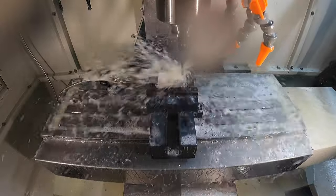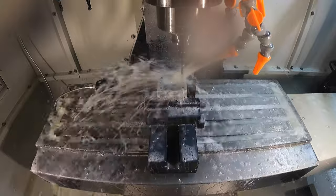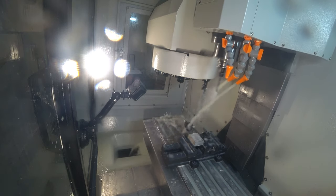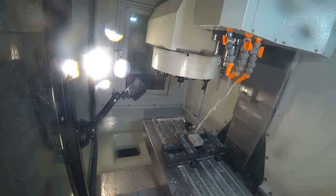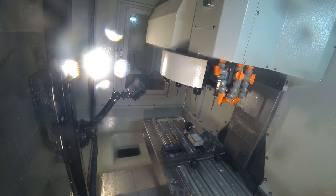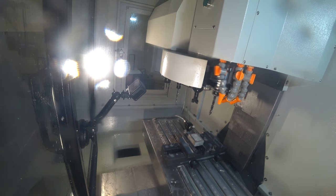This is the last .201 drill location, and then it's going to switch over and do the 3/8" drill. This doesn't take very long, and this hole is going to go all the way through the bottom of the stock.